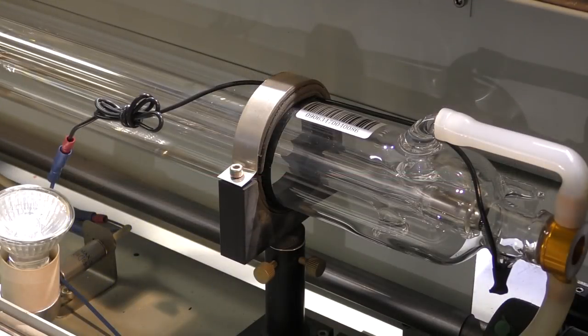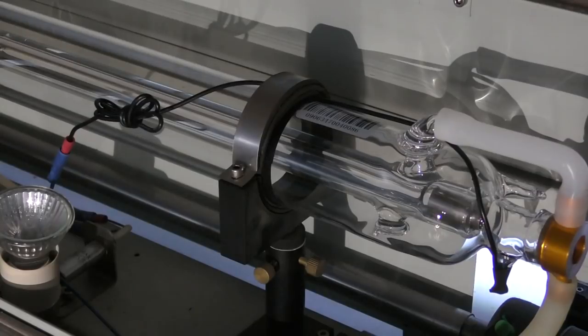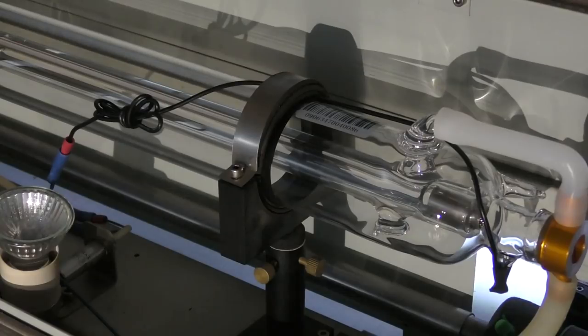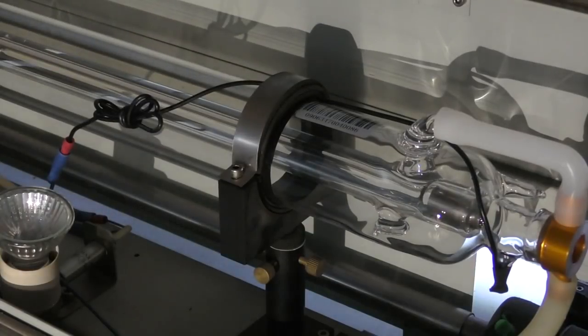When you hear the little beep I've turned the 25,000 volts on — there's nothing happening just from the voltage alone. Now I'm going to allow a very small amount of current to pass through the tube as well — you can just about see a little bit of a pink glow at the end of the tube. I'm now going to allow more current to flow, and now I'm going to put the maximum allowable current through the tube. I think you can see clearly the different intensity of light coming from the tube.